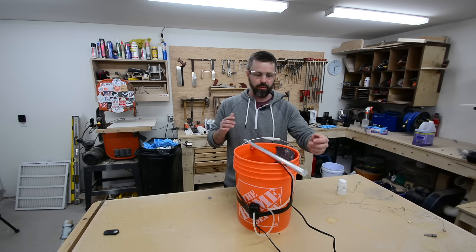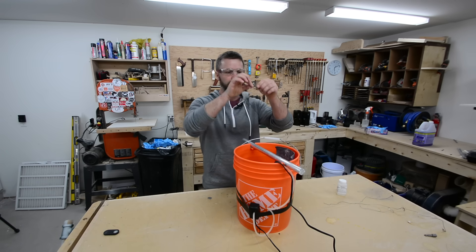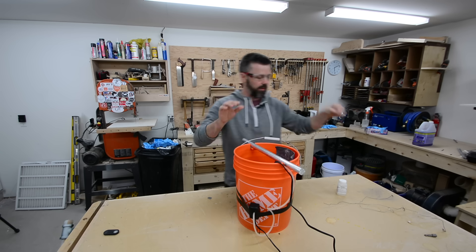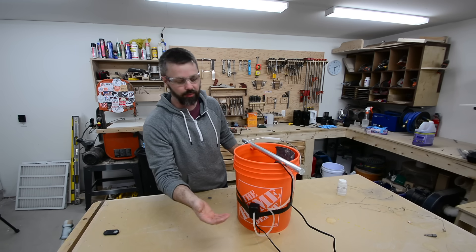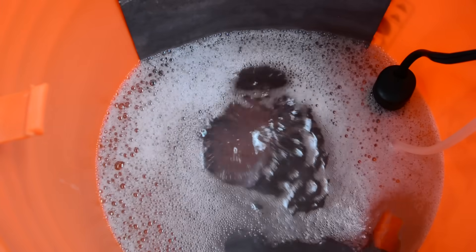Next is the anode. I just have aluminum bar crossing it, but titanium wire is what I'm going to hang the part on - that's where your positive charge will go. And then finally, I have this little fish tank air pump. All that's doing is adding some agitation in the tank, because you could potentially get some bubbles build up on your part and that could cause a defect - the agitation will just knock those bubbles off.